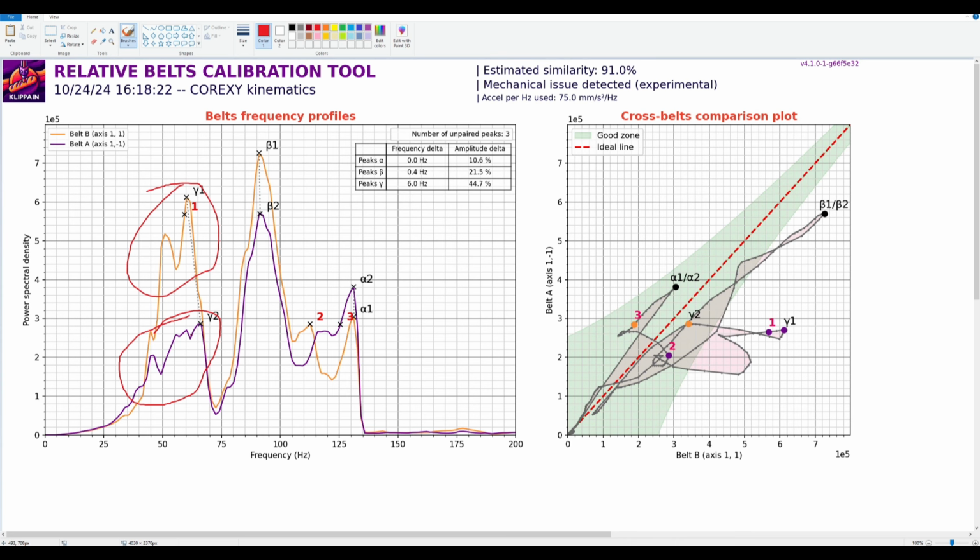So what I'll say here on this one is I'll say tighten A, and give A a good half turn, and we'll see what that does. Will it calm this down? Will it bring this up? What we want to see after we do that turn on A is we want to see it come in here at least. It may not come in, so this is over the 50, usually around here somewhere. It may actually bring it this way. But I want to see some sort of peak here, because at least we know we're in the ballpark.